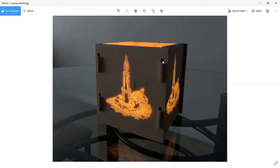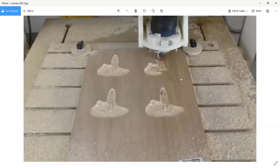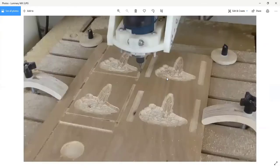As you all know, plywood is never the same thickness. This is 1/4 inch plywood, but it's not 1/4 inch. It's like 0.21 or 0.22 or something. And the problem is when I do the programming for this, I want those slots cut into the side of this piece and the tabs to be the same thickness. But if I take this program a year from now, buy a different piece of plywood and try to make the part, I have no idea if any of that's going to fit. And so what I did, you can see it there.